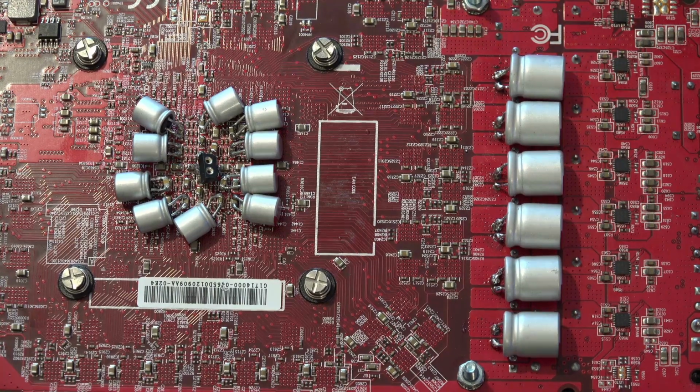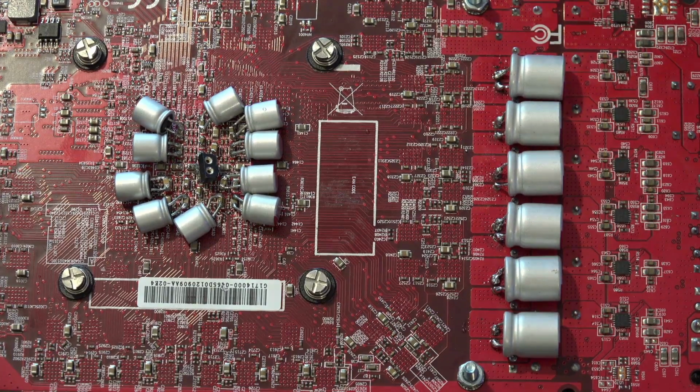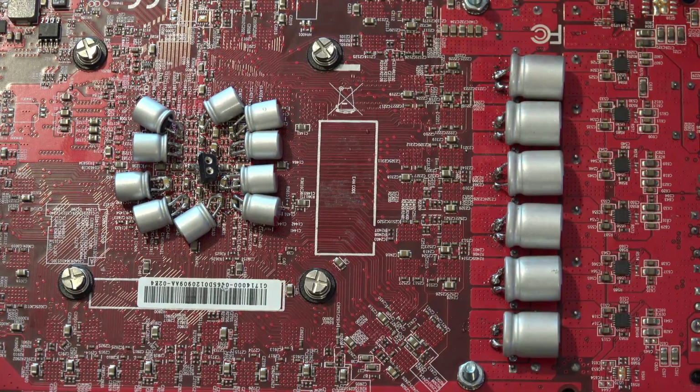But I didn't do that test yet because at this point I've spent several hours on it already. Anecdotally, if you see this card again and it's missing all of these capacitors, it's because I decided that they don't actually help, or that they don't help enough or something like that. So anyway, basically just cramming your capacitors right behind the core theoretically should be better.